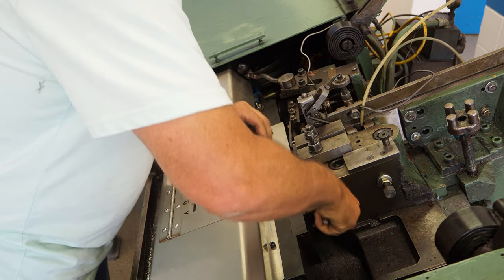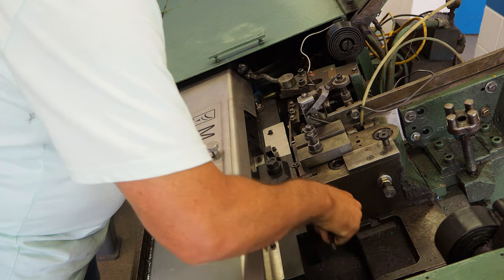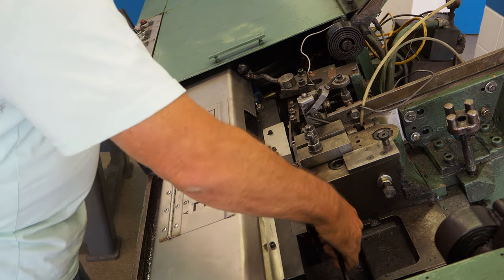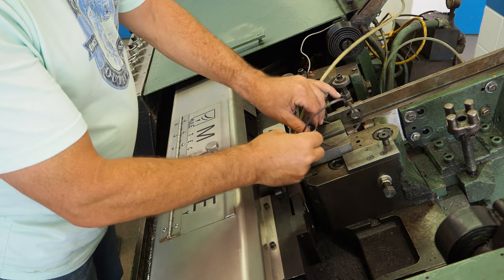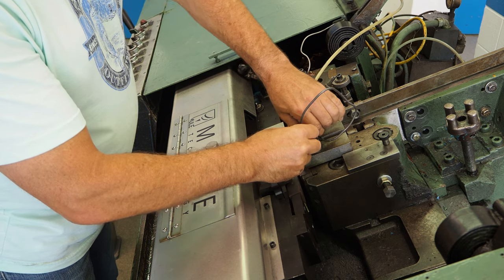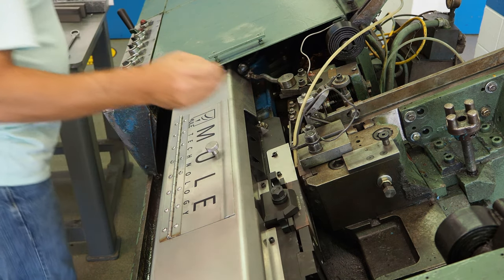You may notice that I'm not performing a half roll — I have a future video covering this. I'm spending a little more time making sure the long die is properly pressured against the mule bars and discs. Then I would like to add a little bit of air to the system. When I run a space thread, I like to run at full speed to take a look at the threads to make sure they're fully filled out.